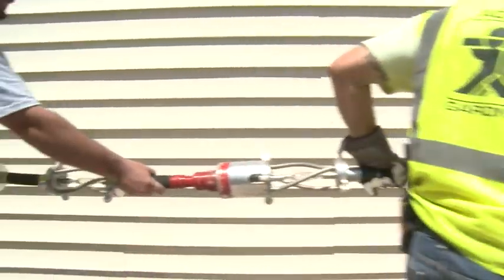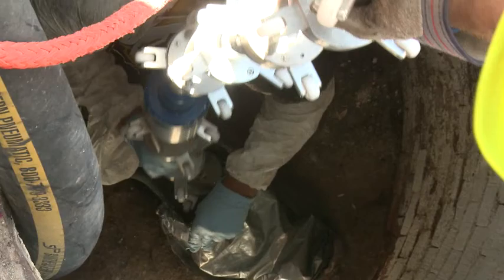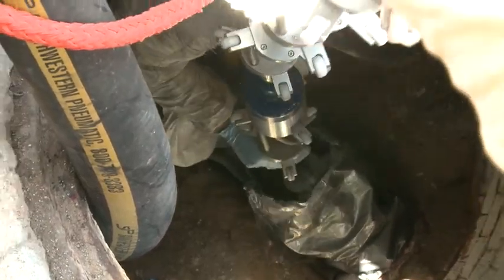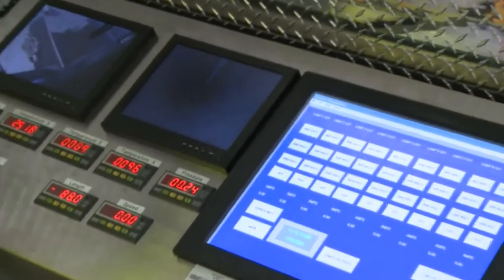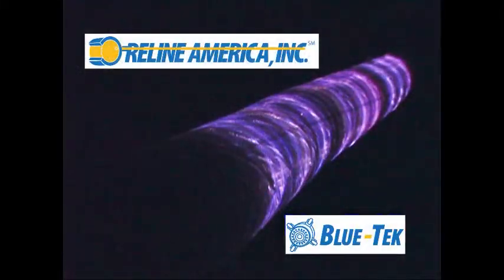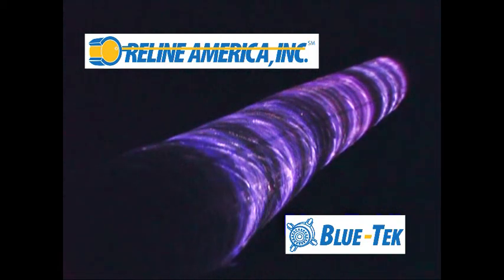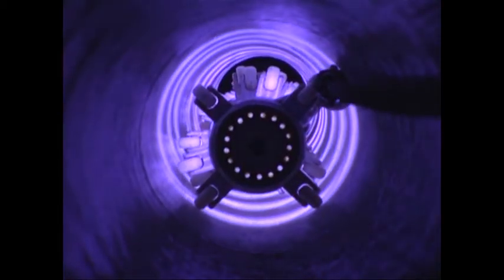Reline America's advanced light chains are inserted and used to cure the liner. Reline's process provides a controlled and computer-documented liner curing using UV light. Innovative BlueTek UV equipment technology using powerful UV noble light allows for curing times of 5 to 8 feet per minute.